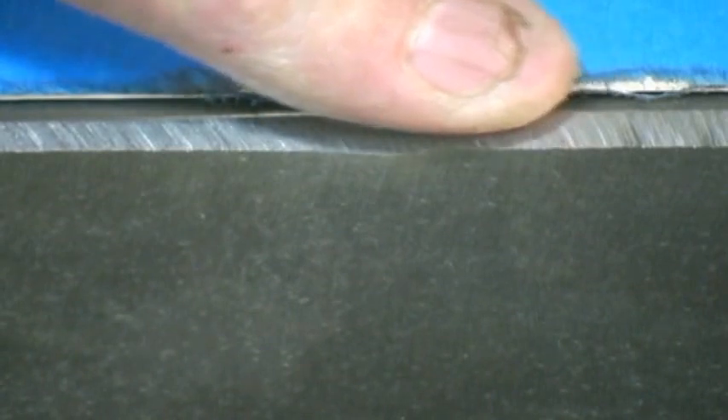As you can see, this has almost disappeared and I am cutting into my strip. The smartest thing for me to do at this point — I'm going to loosen these pads and shift this whole thing back about a sixteenth of an inch. That way, working at this same angle, it ought to allow me to get a little better control. Now I want to take my file. If I keep this file where the masking tape on the file is against this, then there's no way I can ruin that spacer and that angle still. So at this point we can just start filing.